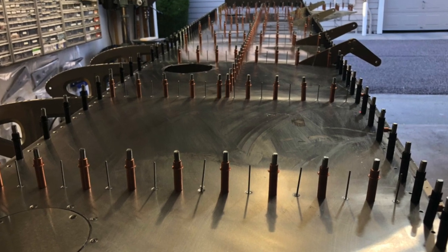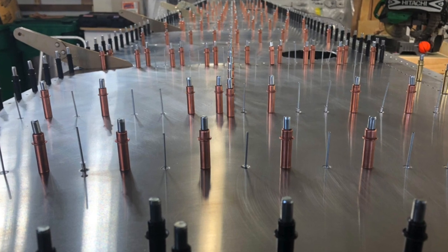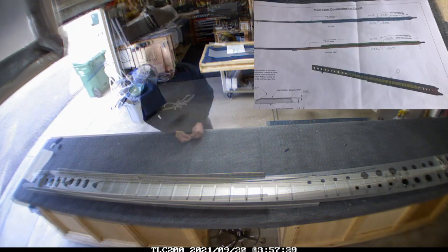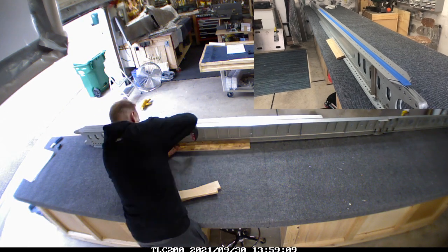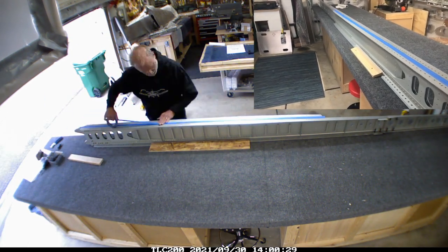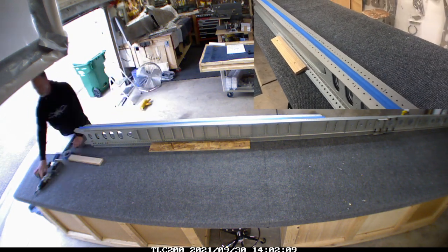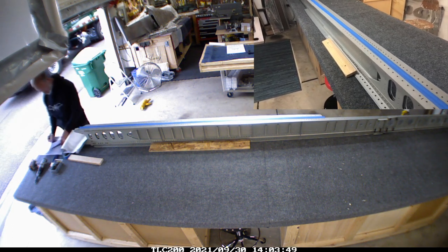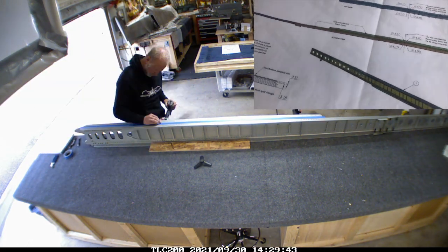I attached what I could and moved that over to storage for the time being. I tested to make sure all the rivets fit into the holes, cleared off the bench, and brought over the other piece. I laid some tape down between the joints to prevent the metal shards from the chamfers I'm drilling from falling in there, because they are kind of small.